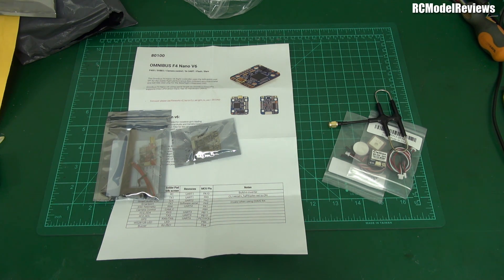All this is going into the sub-250 build. I'll use a 1000mAh LiPo in the meantime as a reference against the Bonsai for flight times, but eventually I'm switching to an 18650 Panasonic pack, which will give me 3500 milliamp-hours at around 7.4 volts — that should give awfully long flight times.